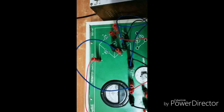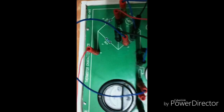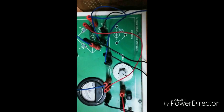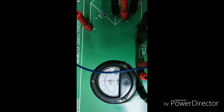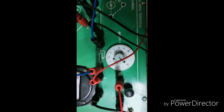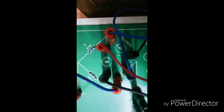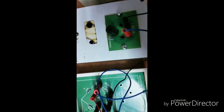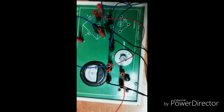Good morning. Students are asking me about thermistor experiment connections. We have here a thermistor board to find out the characteristics. We will observe some connections already made. We have the microammeter and power supply. We will see the black color and a knob beside the white color. We have a Wheatstone bridge with two constant resistances, and beside that we have a heating element. Inside the oil bowl we have a thermistor.